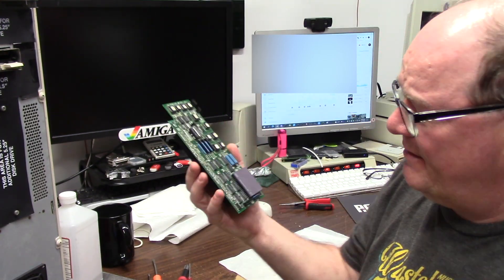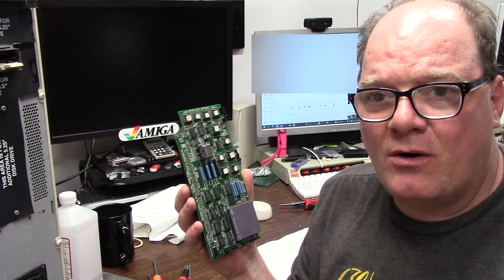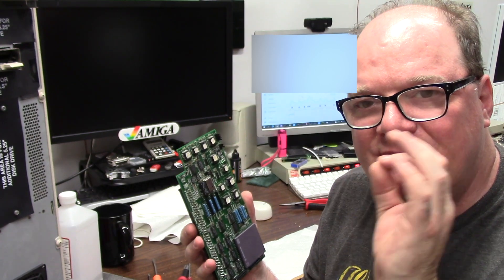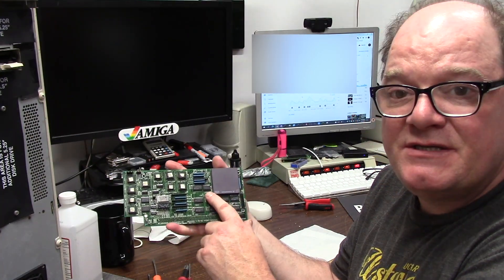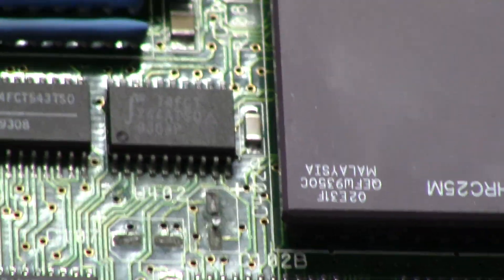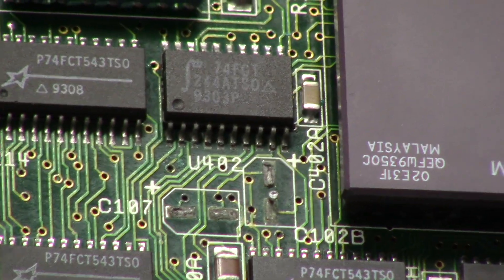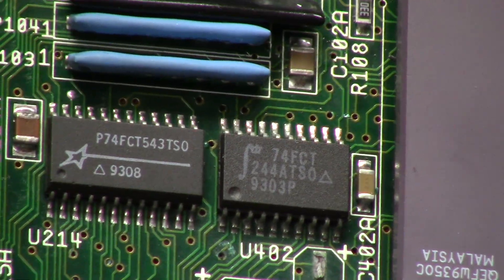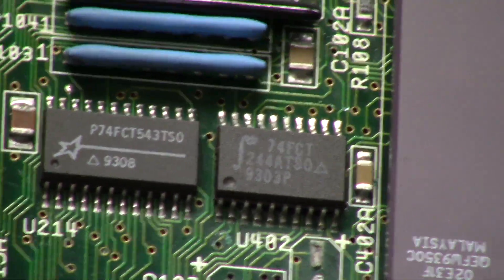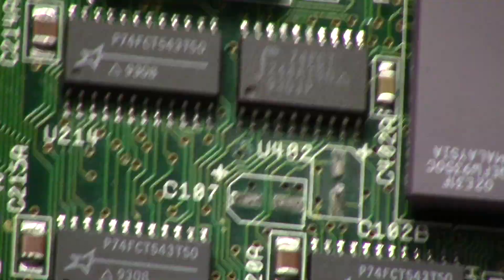You can't really see it with the camera but it just looks like somebody washed this in mineral water and it just dried — that white dusty-ish dirty water look right next to the 68000 where a capacitor was. This is really green. So there's a capacitor right here that was there and must have shot its load all over this board. I might have to replace that, and if so I'm just gonna cut that sucker out too.